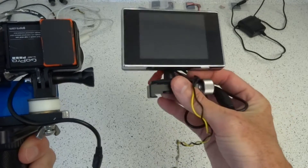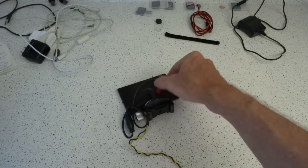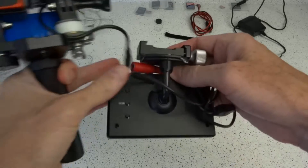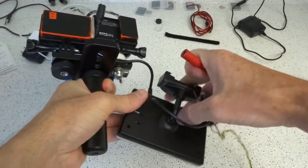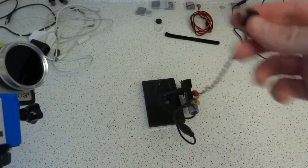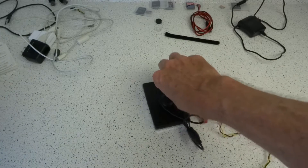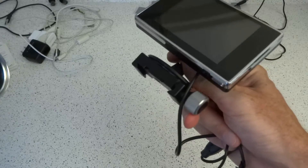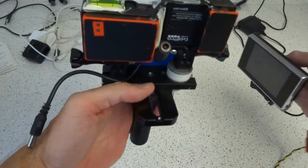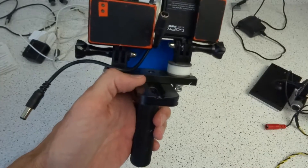It's made for an automobile backup camera but it just has 12-volt power. It also has audio in but you don't really need that so I've cut that piece off. It's just got 12 volts in, which I'm using this blue battery for, and then of course the plug to the GoPro. You can pretty easily just hack these up to make them a bit more compact. I just basically glued the base onto a very narrow Arca Swiss clamp that fits onto this thing so I can just put it there or not have it there at all.